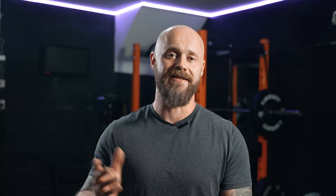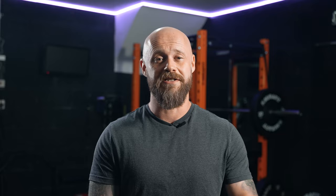The next step was painting the walls, and I knew I wanted black walls for the look I had in mind. I'd spent months painting my old house, so I felt like I knew what I was doing — but painting breeze blocks is very different to painting smooth plastered walls. I massively underestimated how much paint I'd need due to the deep textures. I was also using standard rollers and brushes, which aren't really fit for the job. After three coats, there were still a lot of breeze blocks showing through, so I bought a proper masonry set of brushes and rollers with a much longer pile.